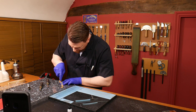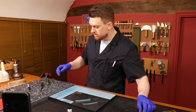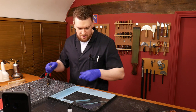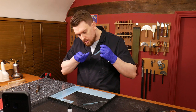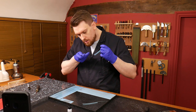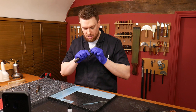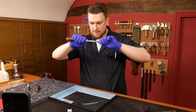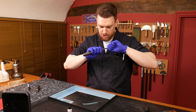Not bad, considering there's no polishing. So I'm going to put that to the side. Eight millimeters is the next one. So again, I've got another piece of leather with 2500 grit on there. Very, very shallow milling marks, but those milling marks — even if I was to polish the outside — would cause serrations because the surface above isn't perfect. So let's try that. I'm keeping that angle low, not pulling at a steep angle. I want to keep that angle shallow — that's what we need for that really smooth, easy cut. It's like a similar angle to a skiving knife. Very shallow.